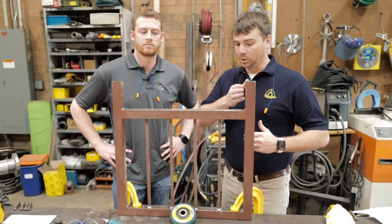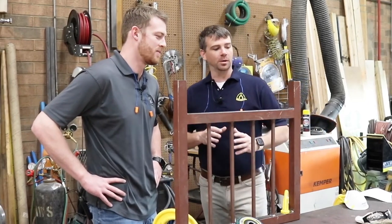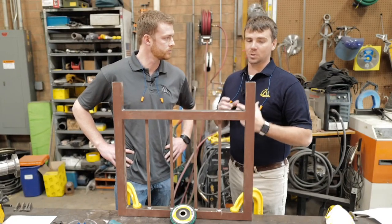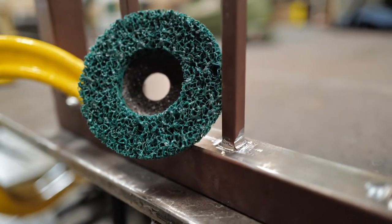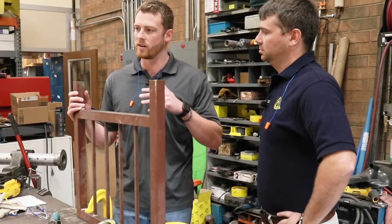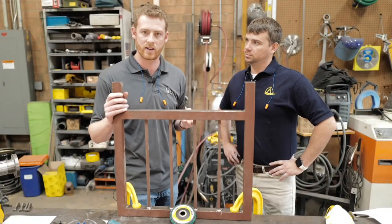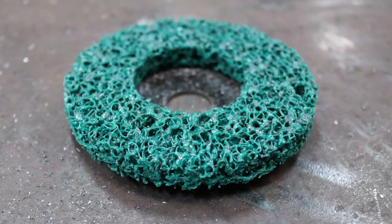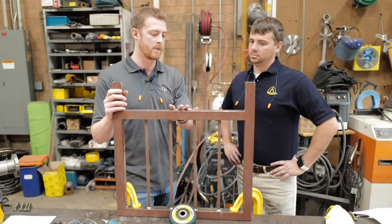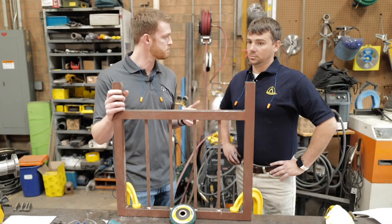The welds are taken down looking really nice and uniform — the carbide burr removed them fast with a great finish. Now we need to take the paint off. Our next product is the NCD 200 HD, our new power wheel at Klingspore. Most industry power wheels use a silicon carbide grain with emphasis on finish; this one uses a ceramic grain — compressed nylon fibers, resin, and ceramic grain — making it much more heavy duty. You get more service life, more aggression, and it's great for removing paint, rust, mill scale, and general cleaning and blending.